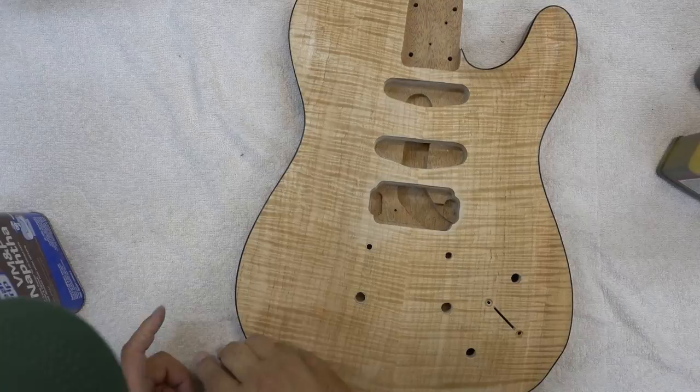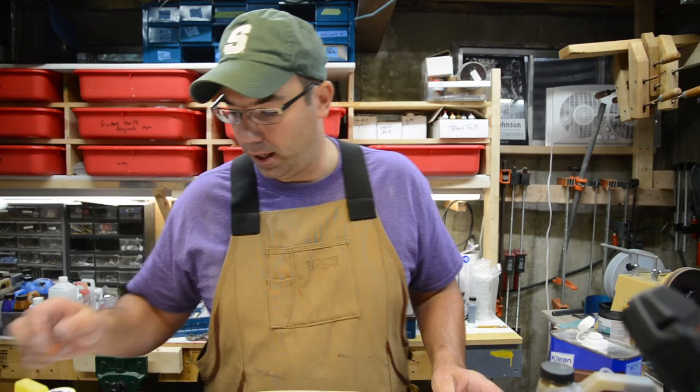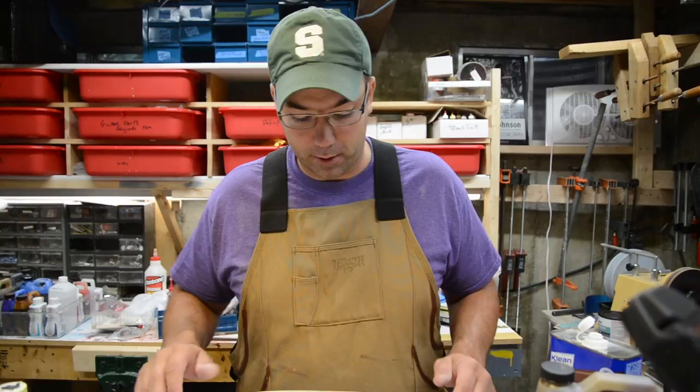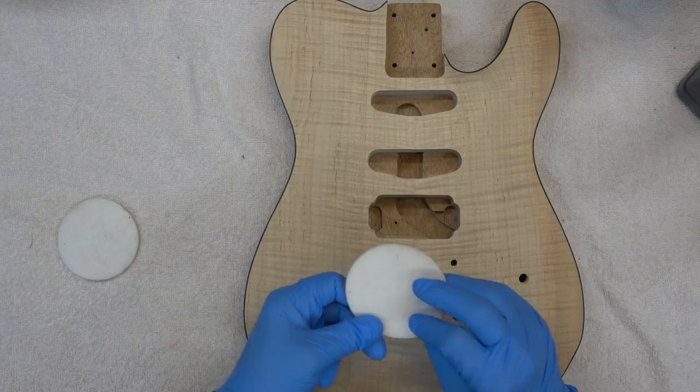We'll let this air off and come back using Angelus Leather Dyes. We're going to start with the dark brown, get it nice and thick, and then come back with Angelus Yellow to lighten it up. We're going to leave the brown significantly darker than I have in the past because of these dark spots — also he wants a darker honey burst. We're going to do the same thing to the neck as well, so it's going to have a really neat dark effect. We'll use these application pads for the brown; they hold more stain than a standard t-shirt and I don't want any runs on the side.